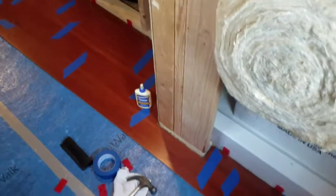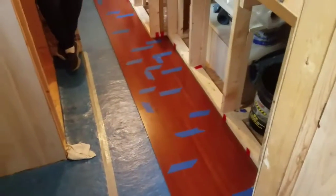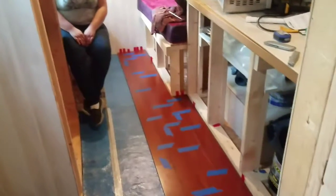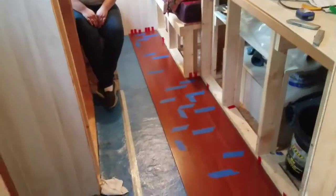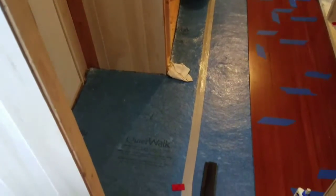For those of you who want to put a hardwood floor in, the biggest thing you've got to remember is to set that first edge straight. That means messing around with spacers and making sure everything is going to line up right, so that when you finally get to the other edge you're not cutting on slants.